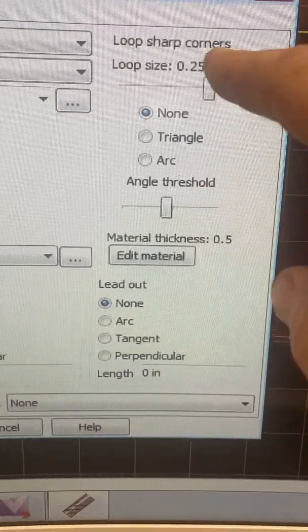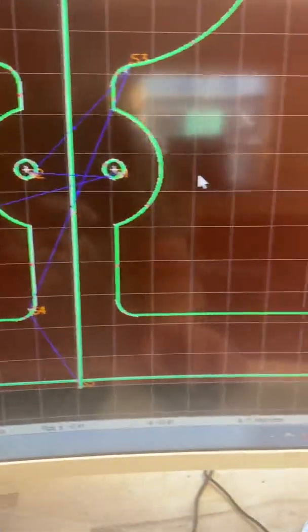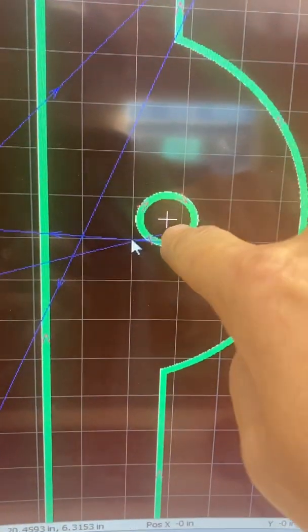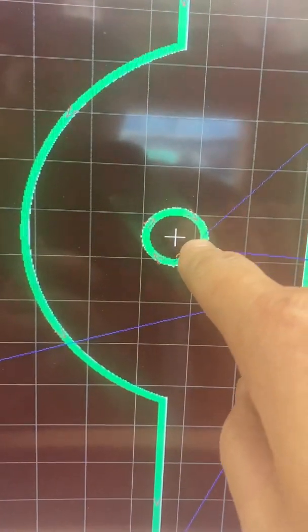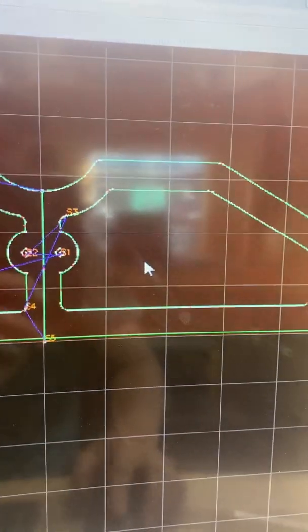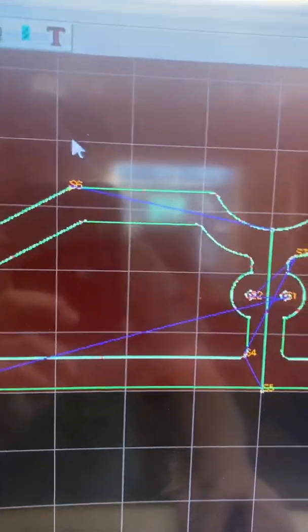Loop size and all these things matter. When I click OK it just generated a G-code, and here's my image — you can see it's all in green. The lead-in is going to be right here — it says S1, so it's going to come here with that little arc as my lead-in. S1 is going to cut a circle, the torch is going to shut off, lift up, come over here, touch down to S2 with my little lead-in, and then come off. Then it goes up to S3 and cuts the inside of this door panel.